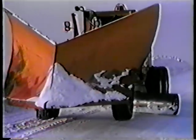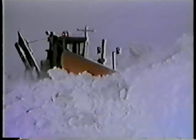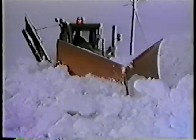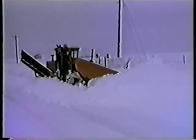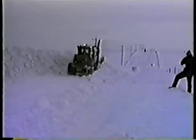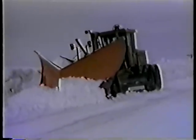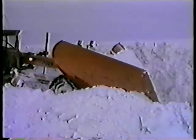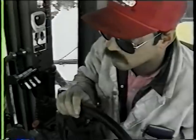The V plow is used to open roads when the snow is thick and deep. It is easy to get stuck. The two most important points are: stay in the middle of the road, and don't let snow come over the V plow and fall onto your side. Snow on your side of the plow can cover the front wheels and make it impossible for you to back up. If you are plowing downhill, even a little snow coming over the V plow can get you stuck. Speed is the controlling factor — you must hit the drift with enough speed and power to move the snow, but not so much as to bury the front of the motor grader. Stopping in time to back up is dependent on how fast you're moving, so be cautious the first few times you're doing this job. If you can watch or talk with an experienced operator, it will be helpful to you.